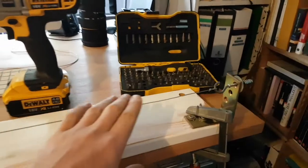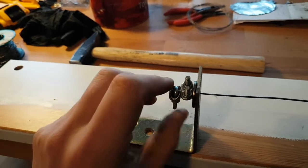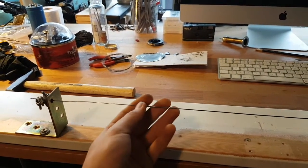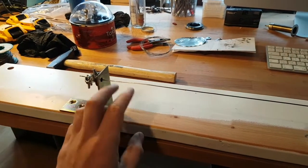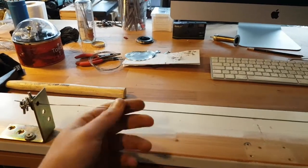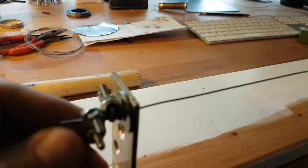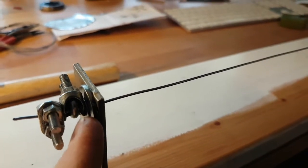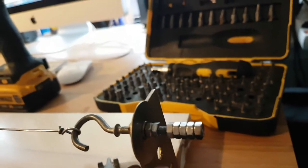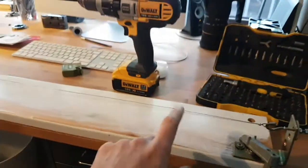This is a bit under tension. So what I do — I have this hook here and these L-shapes. The reason I have them like this is that when I have the coil, I need to remove it from this base wire. I need a non-destructive way to get the coil out. But if you are making instrument strings, of course you don't need to remove the coil from the base wire. These are just secured on the wood, and there are some washers here, one small washer. The reason it is small is to minimize friction because this needs to spin. There is also another small spacer here. This end is where you apply the tension — tightening these screws gives tension.